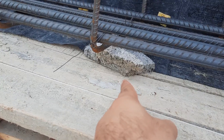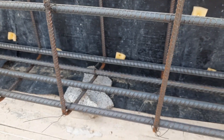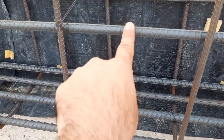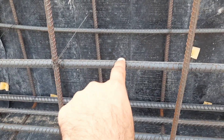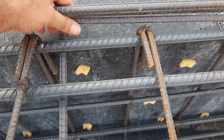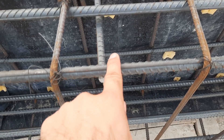You can see the concrete block cover which is 1.5 inches or 40 mm. We have four bars at the bottom with diameter 16 mm, two side bars with diameter 12 mm, and three top bars which are our compression bars with diameter 16 mm.